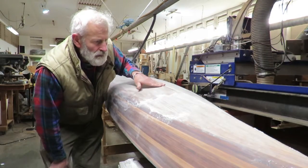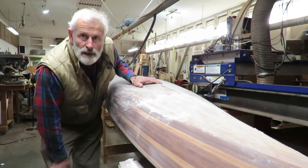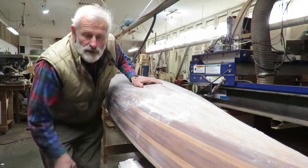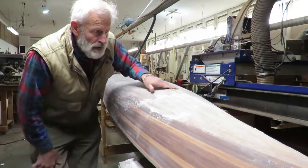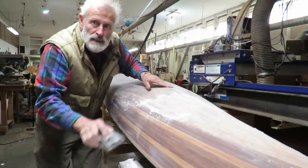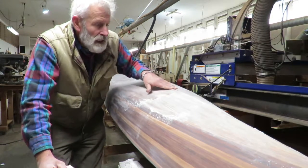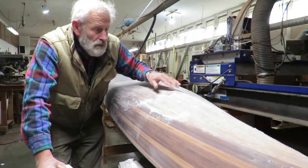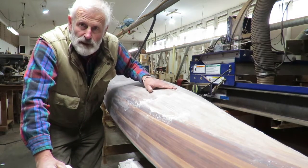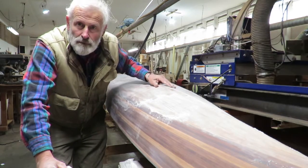Along the crest here, you really don't want to even hardly touch that with the 180 grit sandpaper. You'll sand right through instantly if you touch it with a sanding block on the top, right at the point of the V. And that's probably one of the more important places to have the fiberglass cloth intact, where those two bottom panels come together.